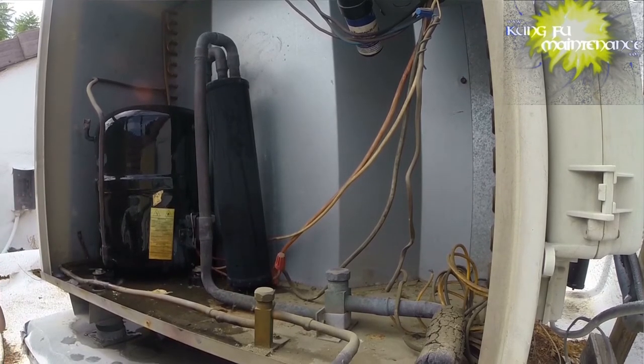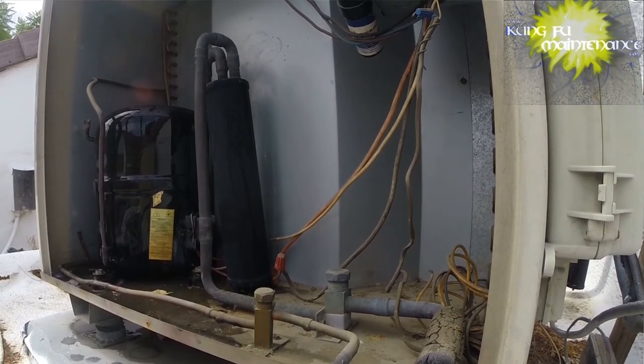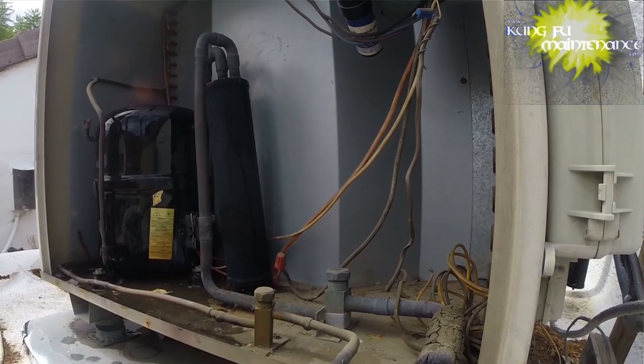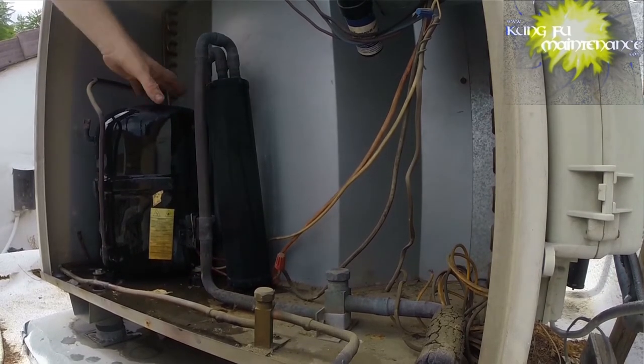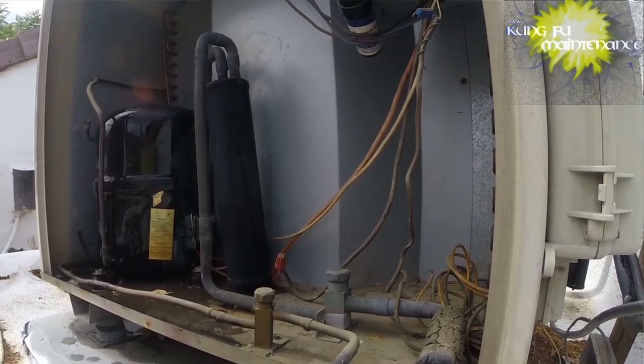The way you're really going to get this formula is by testing it yourself and trying this. The water evaporates and you give up. You know, safety first always, this is a dangerous test for sure. Again, 2650 times full load amps divided by voltage equals capacitance. That shows you the capacitance under load.